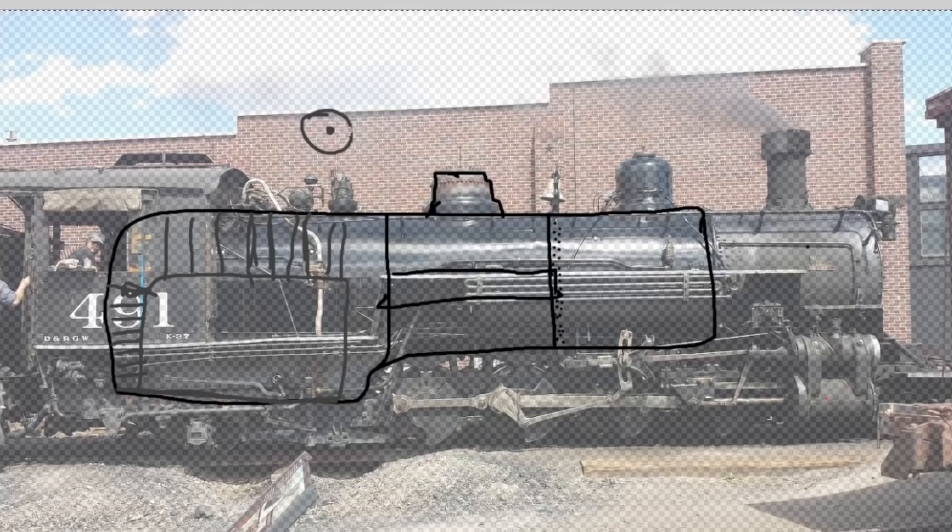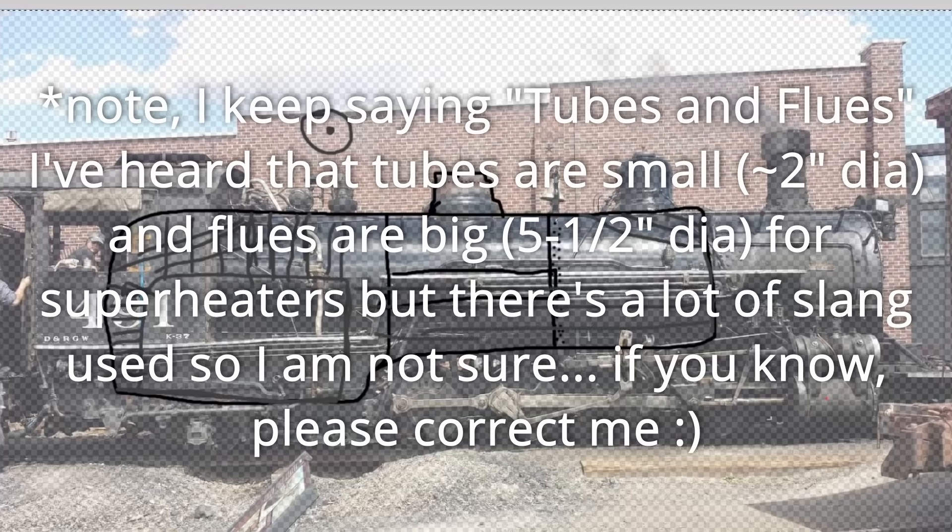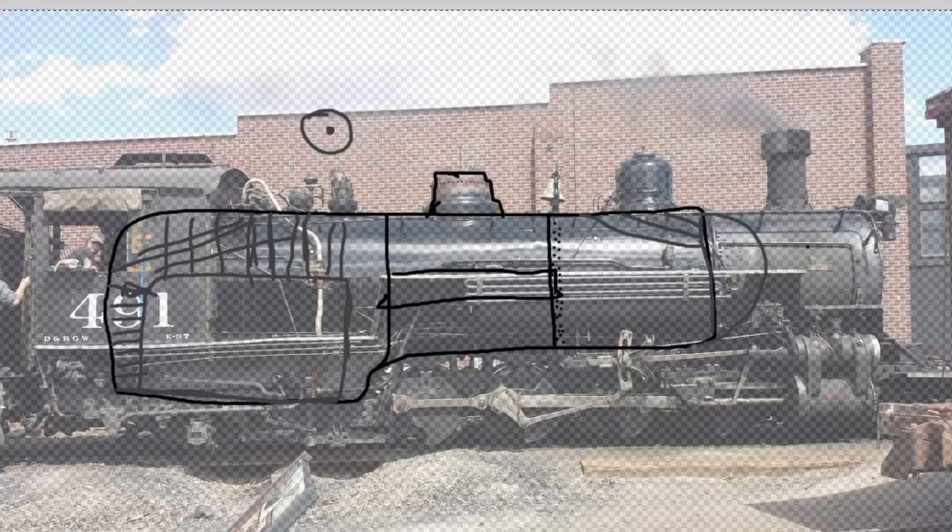There's also what we call bracing in boiler design, where you run braces from the front tube sheet diagonally to different points down the barrel to hold the tube sheet shapes in. The tube sheet is the vertical sheet that all the tubes and flues run through. All the tubes and flues that run through the middle of the boiler have to go from firebox to smokebox and are pressure-sealing, so we make sure those tube sheets stay in place — pressure wants to make them a nice curve, but they're also riveted internally with rivet seams and held in place with braces.